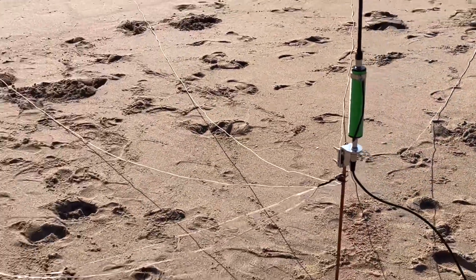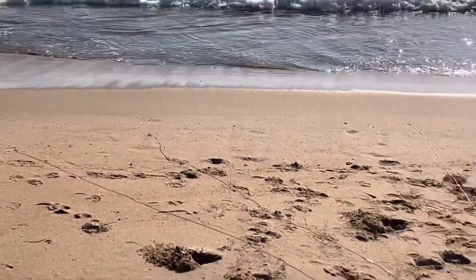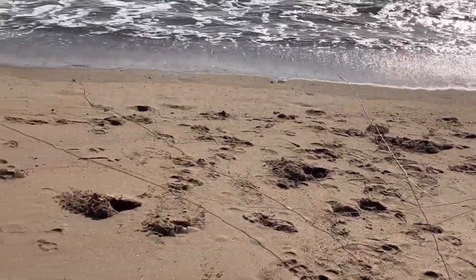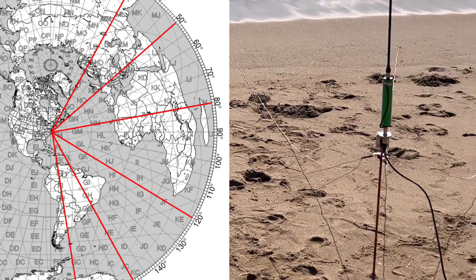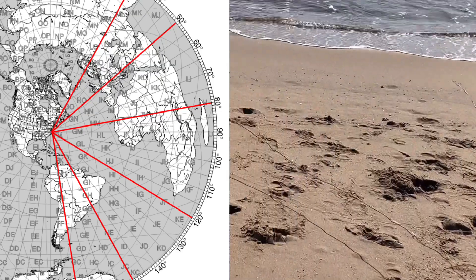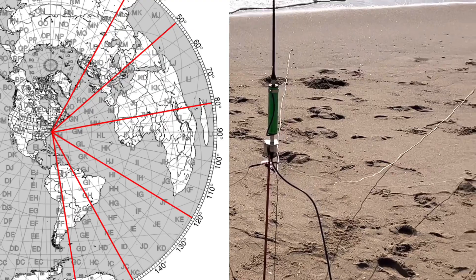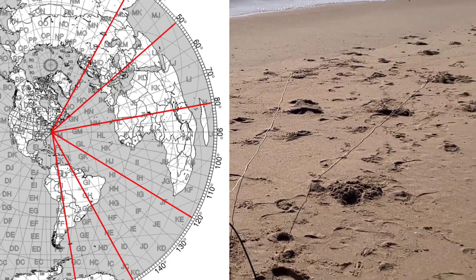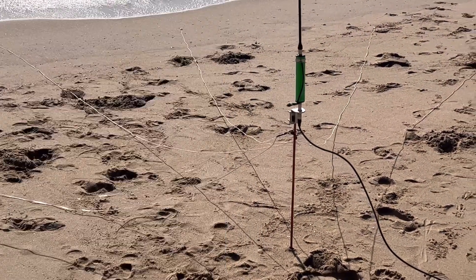With the six wires, one thing about counterpoise wires on the beach: you want to get as much out of the conductivity with the saltwater as possible. I don't have these in a 360-degree all-around setup. The saltwater is coming across the top of them. What I do is strategically aim my counterpoise wires. It's been said that if you use one it's directional, so I set mine up directional as well. These two here are somewhat pointed to Scandinavia and Europe. I've got one that's basically into Africa. One that's down the Atlantic in case I get lucky and do a long path around to VK land. These two are in the Caribbean and South America.